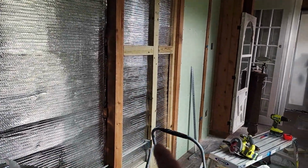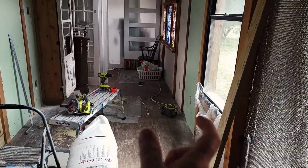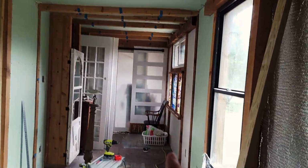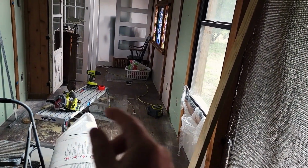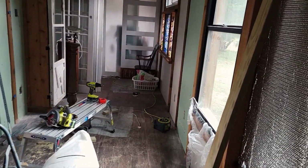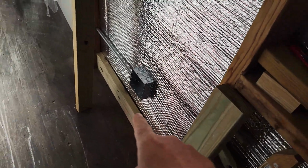But framing. This method of framing that I do adds an extra 6 inches across the width compared to normal framing. So not only do I have a higher ceiling than normal, and even higher again because I bought a high cube, but I also have an additional 6 inches on each side that other people won't have with framing with the studs out like that. And they use metal framing. So there's two ways, right? That versus the methodology that I did, which is why I'm calling it flat framing.